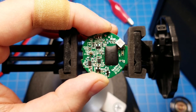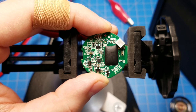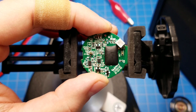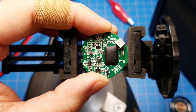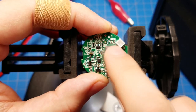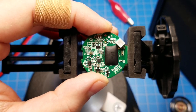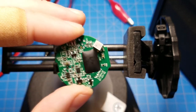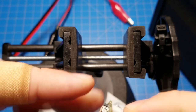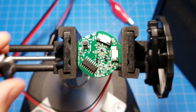After replacing the chip once, it doesn't work anymore. What I think happened is that to remove the chip I had to apply hot air to melt the solder. The board was heating unevenly - part of the board would expand under the heat while another part did not - and I think that caused a fracture somewhere, most likely underneath the epoxy, maybe under one of the bond wires connecting the silicon die to the board, or a trace under the epoxy. I can't really tell. Anyways, this is broken and I'm going to demonstrate how it's broken, how I can temporarily fix it, and then what the heck I can do now.